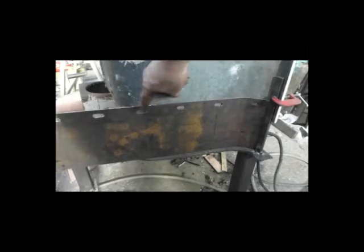So the pieces of plate that I've been cutting out and started to bend are for the bottom edges, to join the bathtub to its base. I've cut them out, drilled them, and slotted them all at the same time, and I'm doing the bends for both sides at the same time. I've got the first bend in, and now I'm going to start bending from here, using small bites to nibble it round to follow the curve of the bathtub.